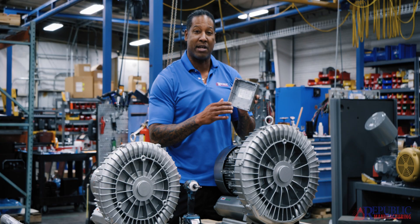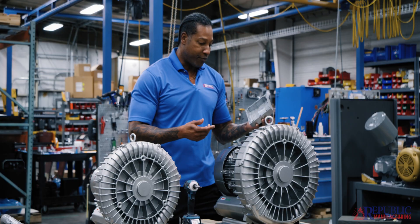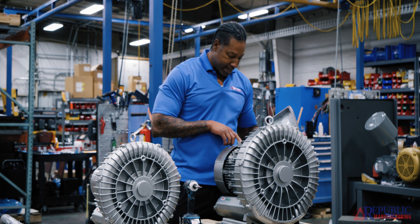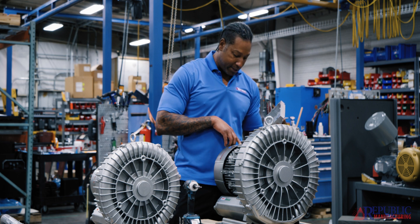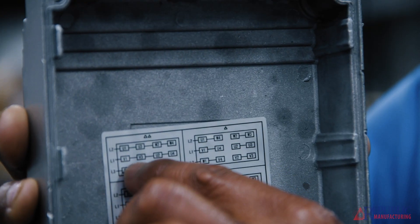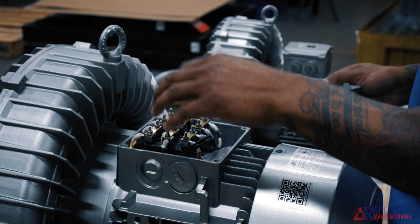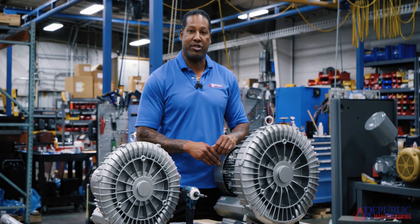It's really kind of confusing sometimes because it's all based off the voltage you have. For instance, if we were wiring up for 230 volt, 60 hertz for this unit, we'd look on this tag, look to see 230 volts, 60 hertz — you notice it says double delta. So we would find a double delta wiring diagram and wire this up for delta delta configuration. Please keep in mind that you might have to remove the wires and put them on different terminals to get to the delta delta configuration.